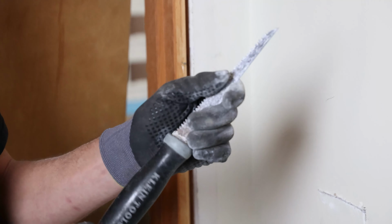You might ask, okay, what's the optimal hole size to drill through the joists? That's a great question. The answer is the smallest hole that allows you to easily get your job done. You're going to have a max hole size that can go in every framing member before it needs nail plates or structural reinforcement. Usually with electrical work and small wiring like this, that's not even a question. It's more about how many conductors you put in the hole.